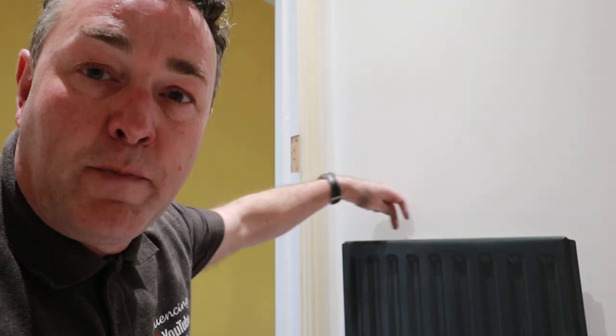I know somebody's going to shout at me and say, use a bigger brush or use a roller. I'm not doing that. I just want to show somebody the principles of doing the top edge, doing what you can see visually on the sides, the fins across the top. Don't try and paint, because what will happen, you'll just get loads of nasty runs coming off them. They are what they are. And I've shown you how to do it, coming across the corrugation and then just finishing off, laying off the little bits at the top horizontally.